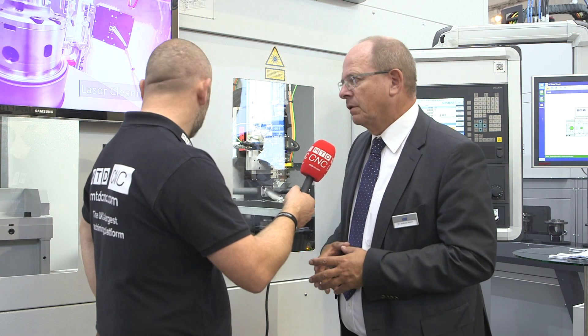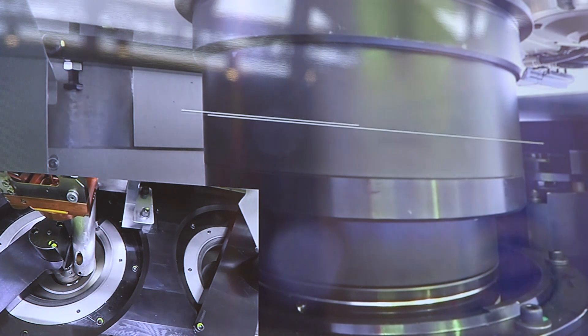And how accurate is the machine? That's the most surprising thing. If you look into the accuracy of the mechanical system, you won't find a difference compared to a cutting machine. Everybody says 'okay, welding machine,' but that's history — we are doing precision components. We go really to the limits, trying to make very slim joints to reduce distortion and heat input, and therefore you have absolutely the accuracy of a turning machine or cutting machine. We are talking about microns.